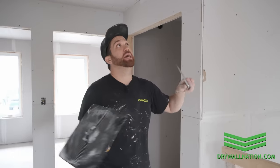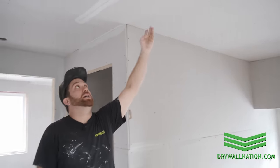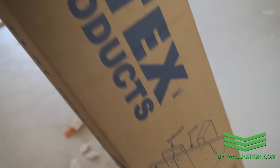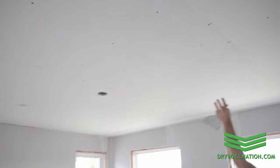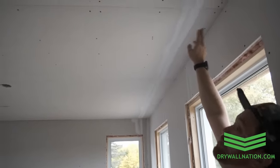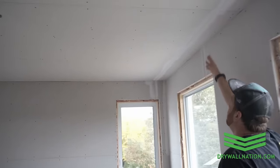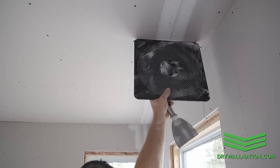You can see here all our butt joints have been v-grooved and everything is nicely filled. In case you're wondering why our joints aren't staggered, it's because we use Trim-Tex butt board, so there's no reason to stagger them — we railroad them. You can see full 12-foot sheets going right to the end with one long railroaded butt joint, so there's no waste. This is a floating joint — structurally superior, recessed, no hump. It's been v-grooved and pre-filled nice and flat, ready to tape. If I put my hawk along there you can see a nice recess along the top, so after your tape is applied there's no hump.